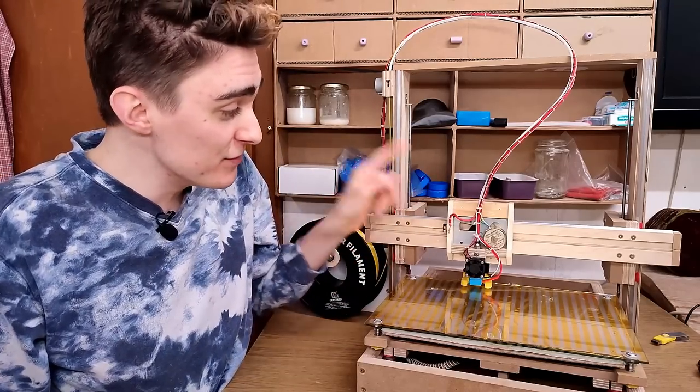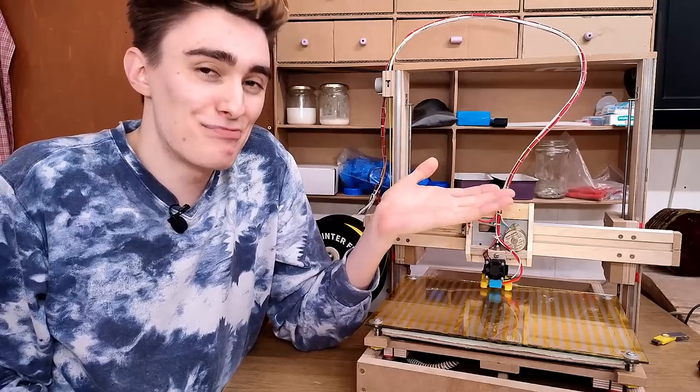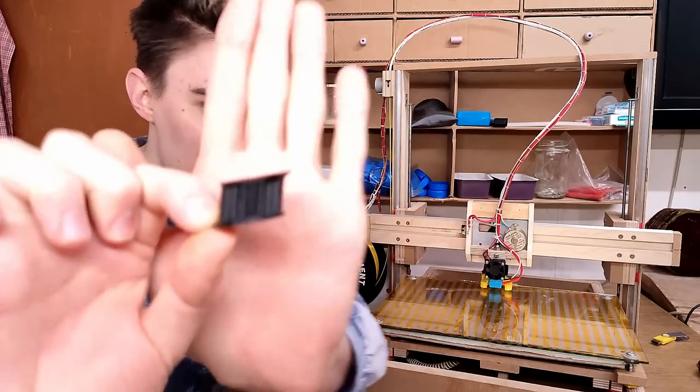That approach comes with a problem. Because it's two separate chips doing their own counting, whenever you try to switch direction and activate the other counter, it starts up right back at zero, even though the other one might have left off somewhere in the middle of the sequence. This results in unpredictable lost or gained steps at the end of each move — on a 3D printer, even just one lost step every time the nozzle changes direction could have devastating consequences.